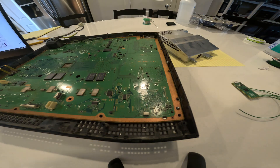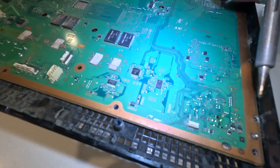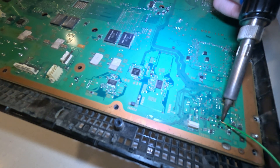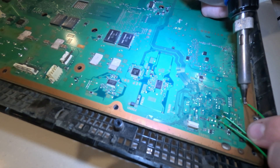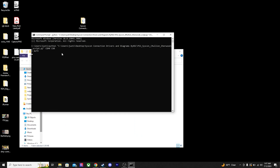The next step is revision-specific, dependent on the model of PlayStation you have. I'll post a link below to help you find the headers for your SysCon. Once you've found which headers to solder to, note that the GP16 header on your Raspberry Pi goes to RxD, and GP17 goes to TxD. Ground can go to any ground point on the board — in this example I used the ground strip on the side of the motherboard. Before accessing SysCon, go to Device Manager and find the COM port your Raspberry Pi is connected to. Mine was COM4, but yours may be different. Please refer to the GitHub for your unique situation rather than following my exact commands.